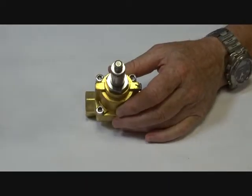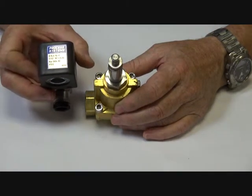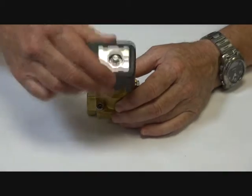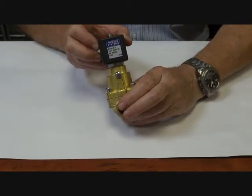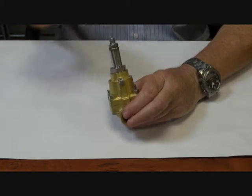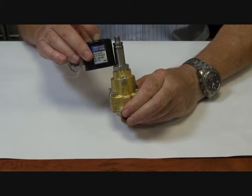The unit can be combined to have either the F coil, which is a flying lead, or the DIN coil which has an IP65 rating. With the DIN coil applied to this valve, it gives the valve a rating of 20 bar, suitable for various types of media and air up to 20 bar. With the IP55 coil it is suitable for steam and high temperature applications up to 180 degrees Celsius, but up to 10 bar rating.